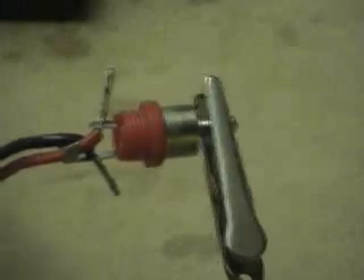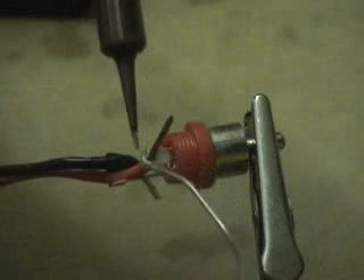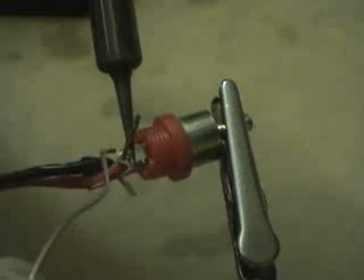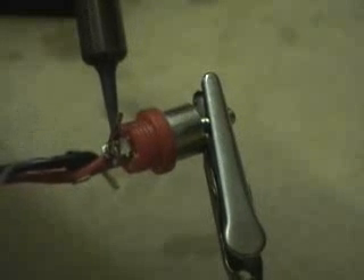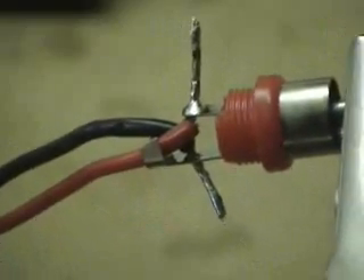My intention is to heat up specifically the pin, because that has the greatest heat sink, and then when I can see that the solder on the wire is starting to melt, we can add a piece of solder to the equation. You can see I'm holding the soldering iron behind the wire and just touching to see if it's starting to melt. I can see some smoke wafting up, and my solder starting to disappear as I tap in, and as it gets hot enough, it should all suddenly just take like glue and adhere — look at that, it's just adhered. Note that I haven't lost any of my insulation underneath, because it didn't get too hot.